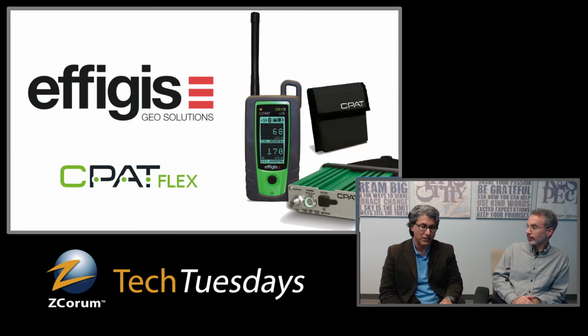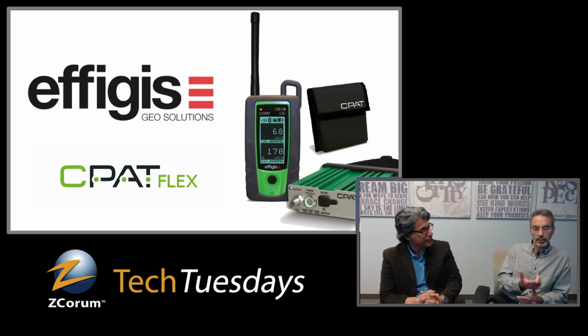So now that you have a consistent signal going back to the customer premises, that's where the detector comes in. The idea is the field tech will walk towards the ground block that's beside the house, listening for an audible tone that will increase or decrease based on detected egress. And you can see the little handheld unit that you're walking around with, and you can see these numbers change. So there's a pretty good indication, both with the tone and then watching the numbers go up and then eventually down, where you've got your issue.